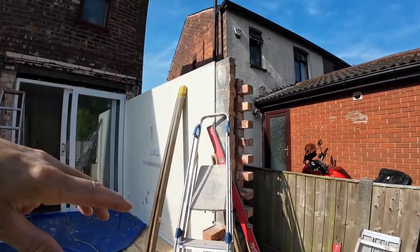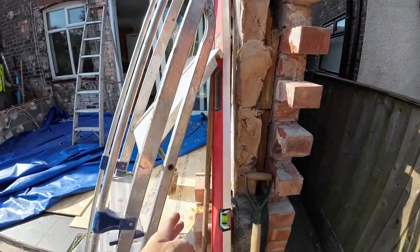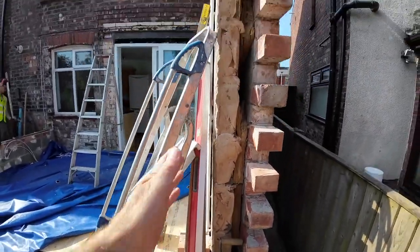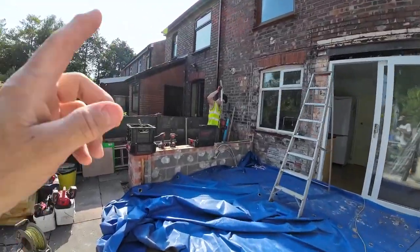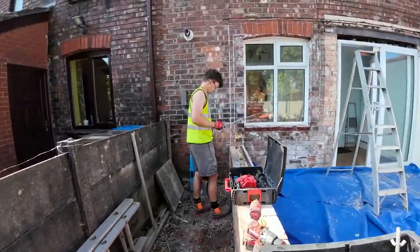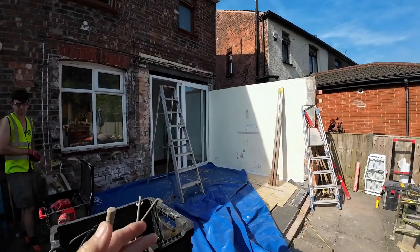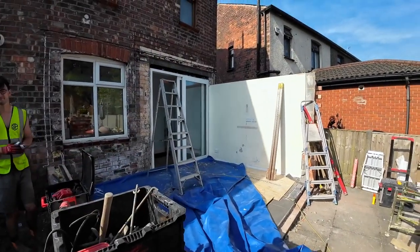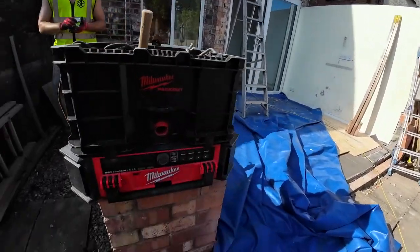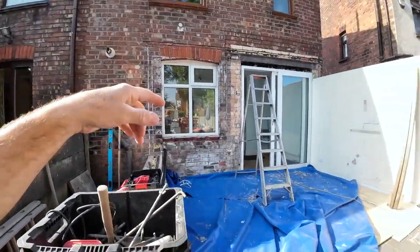Going a bit high with that. Vic's toothed this out here, and cut it back there, so it's going to be a 2-brick pillar all the way up. Same this side, all the way up, basically to mirror image it. So it's 2 high walls, big, I think they're probably bifolds, and again, 2-brick pillar. So Alex just putting the starter packs up on there.